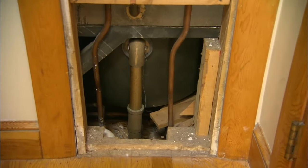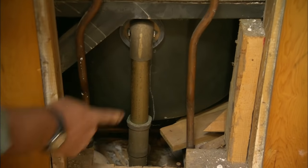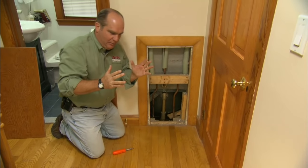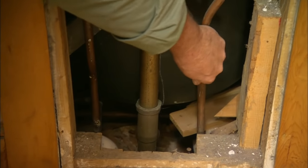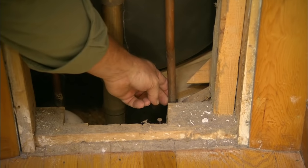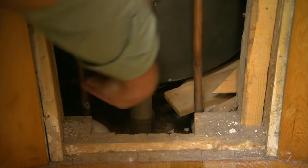What we're looking at here is the back side of the bathtub — you can see the tub right here. Here's the overflow for the drain, and here's our hot and cold piping. Any time I think about water hammer, I think about pipes that aren't secured properly. So I shake this around — the cold's not too bad, but the hot's pretty bad. I could just secure this pipe, and that'll help right here, but these pipes also go underneath the floor.